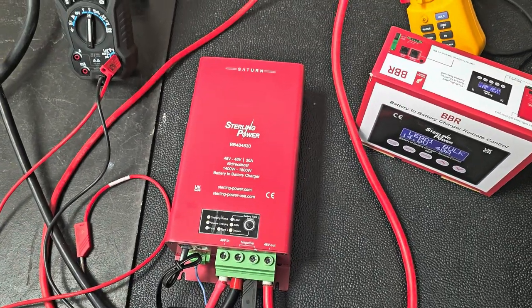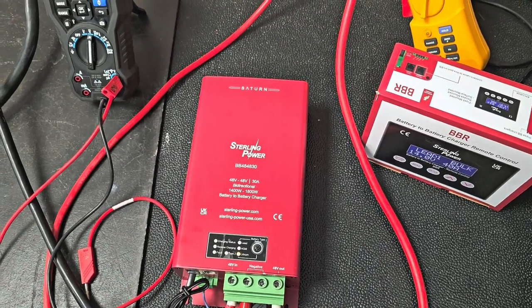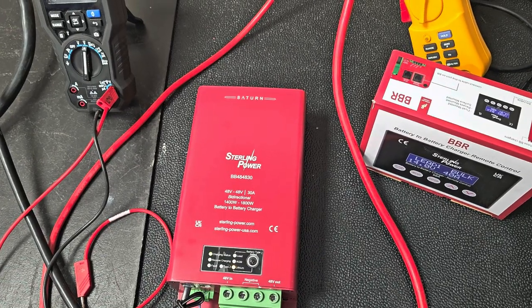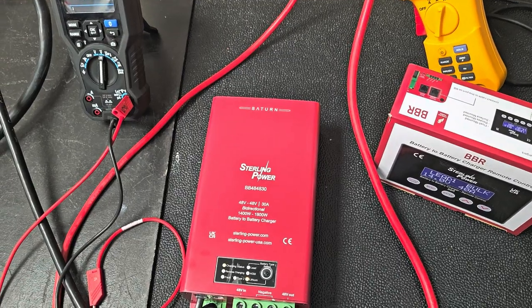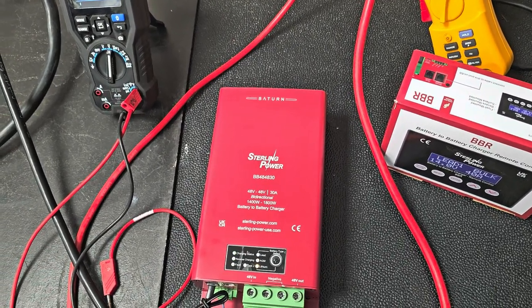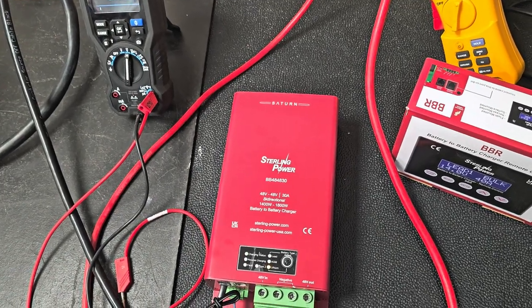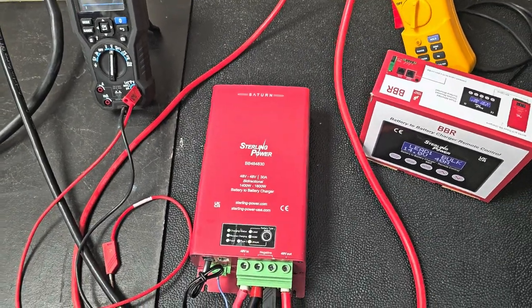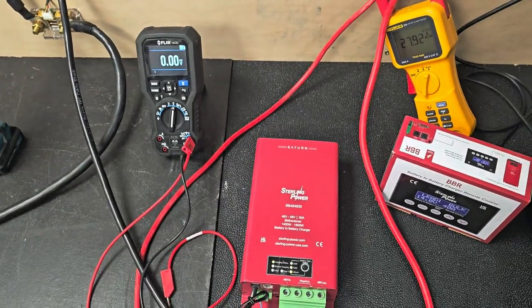The main use for this will be those that have got a 48V donor battery and a 48V recipient battery that are not always bonded together. So you might have a hub battery bank that's at 48V and there may be a 48V battery that is docking onto that 48V stack to charge it up.